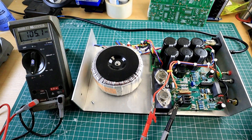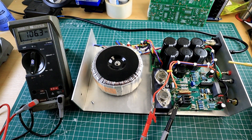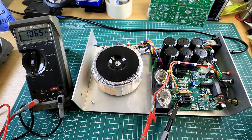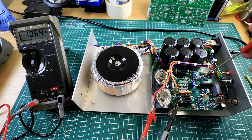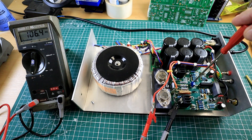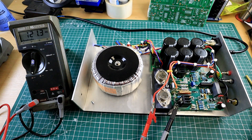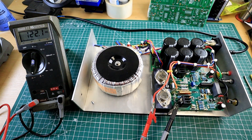After 10 to 15 minutes we've got a nice steady state of about 105 milliamps. Since we're asking for 120 milliamps, the way we can increase that is by turning this blue trim pot. You can use a fancy twiddler or a screwdriver. Turning it clockwise, we bring it up to 120 and we leave it there to settle down for another 20 minutes.